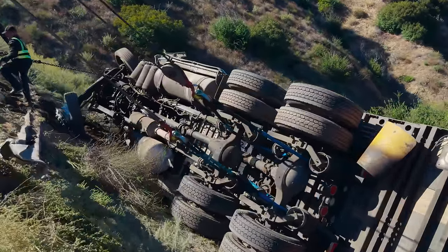You know, in hindsight, we should have parked you further, especially because you got the longer boom, and Hulk can go up higher. But we'll be fine. While they put sand down, keep retracting in and going in with the cables. I'm already tapped out. No, I know. But tap out fully, then retract in, then tap out, then retract.